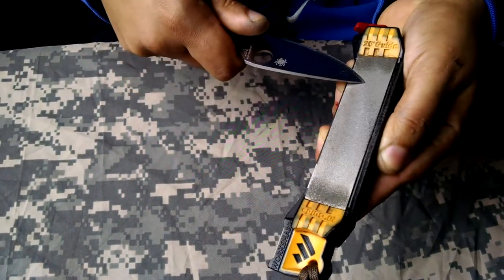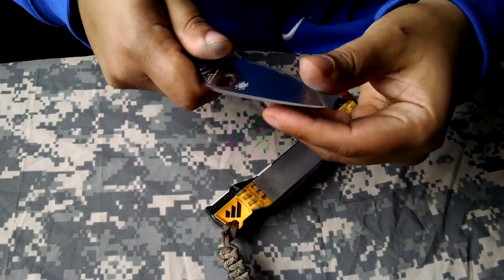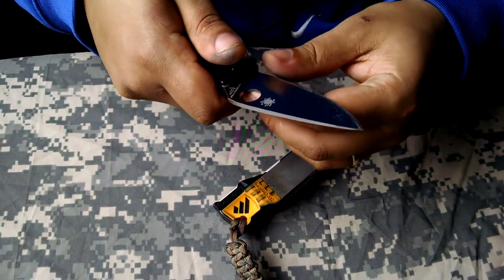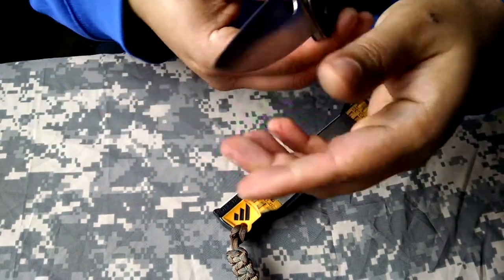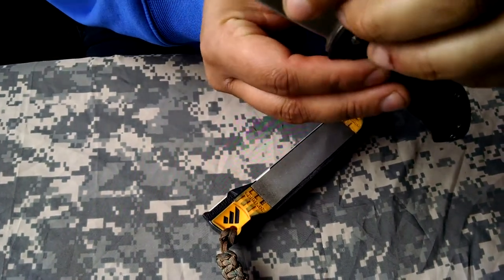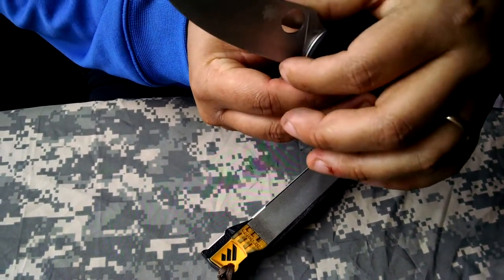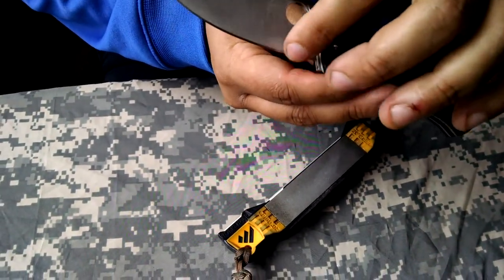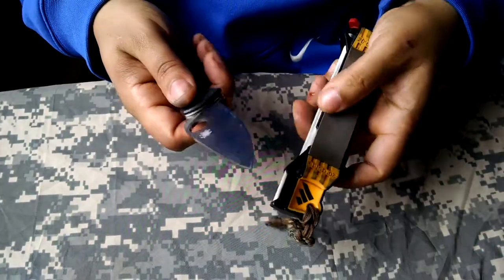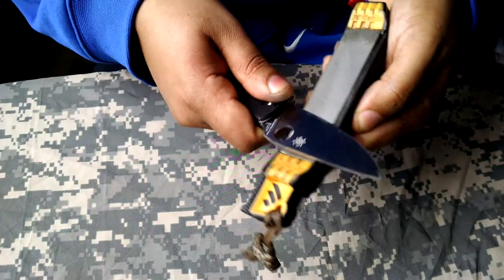You don't have to do this every time you want your knife sharpened, but you do have to do it if you want to touch your knife up at the proper geometry for how you like to cut. We can see I've got the burr a little bit right here, but it could use a little bit more work back over here — I have a problem getting the burrs to pop in that area. So I'll just work that spot.